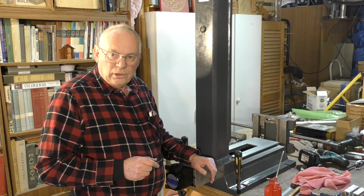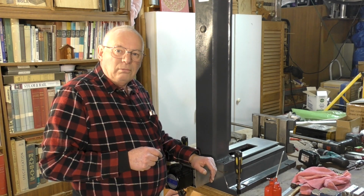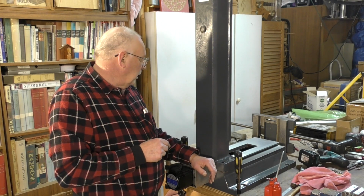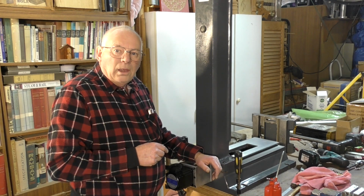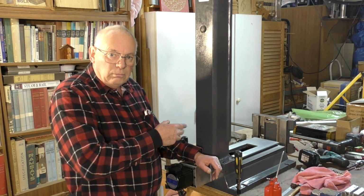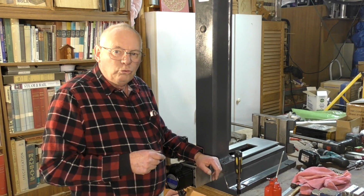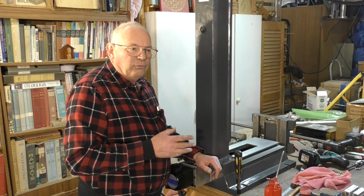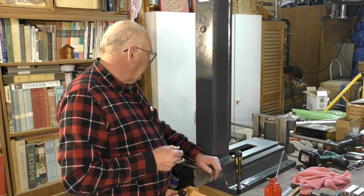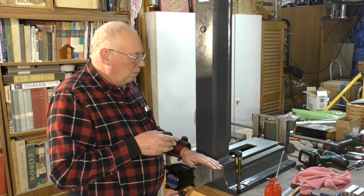So until the next video, where we are going to machine the connection that I was just explaining between the ball nut for the y-axis and the saddle. I should be able to machine all that, mount it, fit it, and get that part of it working. I am expecting to shim it a little, probably, I don't know, could be as much as 10 thou, because there's a little play in this bearing. There has to be a little amount of play, movement then.